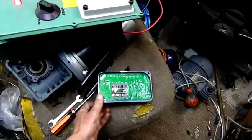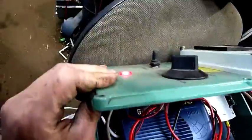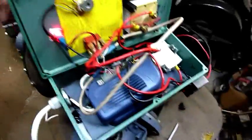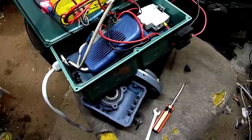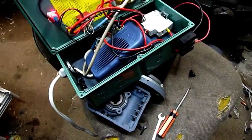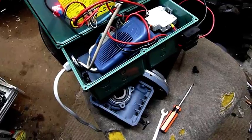I'm pretty sure these are pulse width modulation controllers — PWM. I'm not 100% sure though, but it sounds like PWM judging by the sound from the motor. Okay, batteries on, main breakers currently off, minimum throttle — this is with the replacement Curtis controller of course. Breakers on, let's go forwards — yeah, it's working! About half throttle.